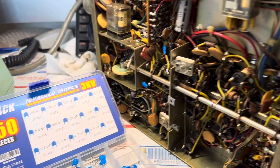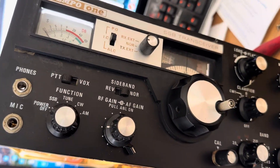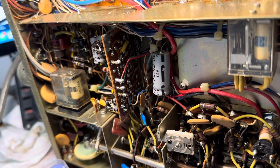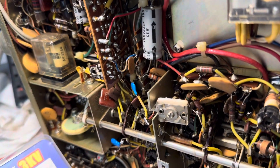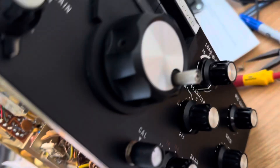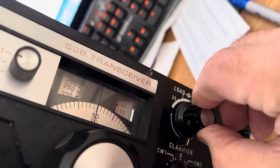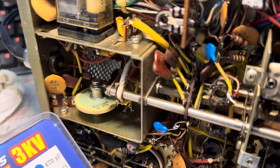Hello friends and followers. Here's the Henry Radio Tempo One transceiver which I picked up. I wanted to go through this thing — it wasn't really doing well on 15 meters, and on 20 meters it was a bit sloppy in the pi network. The pi network means you're tuning and going for plate dip, and it was a bit wide, which could involve the Q of the circuits in the pi network.